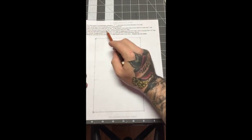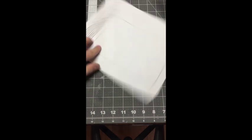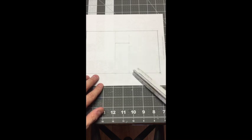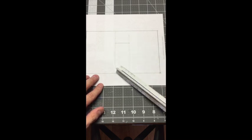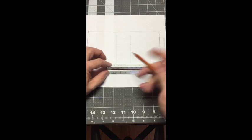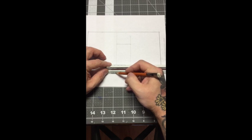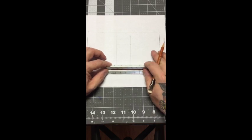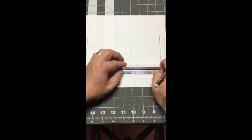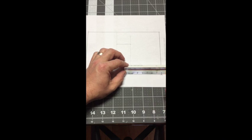Around the door, there is a trim, often called a casing, that is 6 inches wide. Perfect. So let's do this. From the door, all around the outside of the rectangle you've just made, going to start with 0 at the door opening, mark over 6 inches, make a tick mark, and I'm going to come all the way to the center here, 6 inches, right here, and then mark that 0 at the baseline.